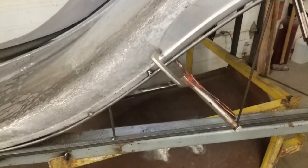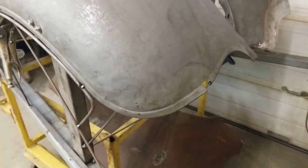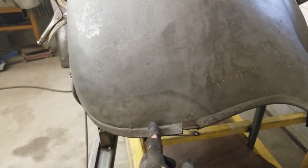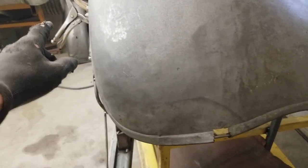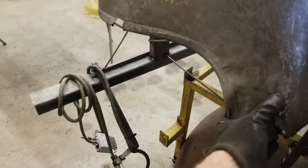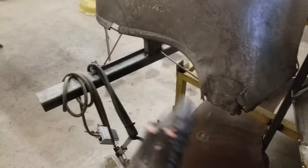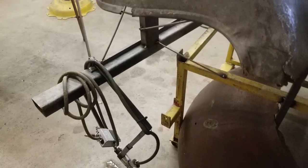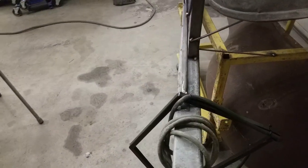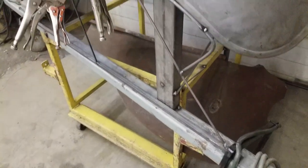Down here is not too bad, and then we'll be moving on to the front. This side is not as bad as the other side, but there's some damage through here — we need to hammer that out, recurve this section, and then replace it. We'll probably be replacing the entire reinforcement rod. Inside here it's really mangled, so we'll have to hammer that out, restore the curvature back to original, and make up a new piece where necessary. That's our planishing hammer there — it saves some manual hammer and dolly work, but you have to use it very carefully because you can over-planish the metal, overwork it, and then you're in a lot of trouble again.